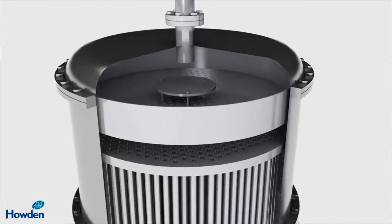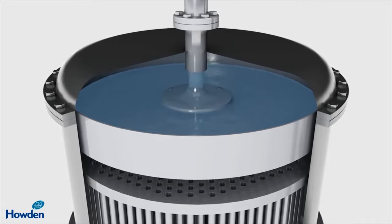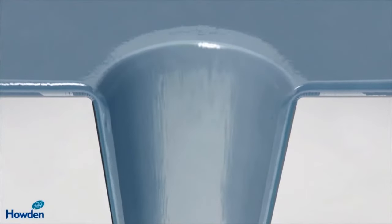In a typical falling film evaporation plant, the feed liquid enters the top of a vertical chamber called a calandria. The liquid is dispersed across a large number of vertical tubes, and as it flows downwards, it tends to form a film on the inside of the tube.